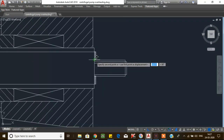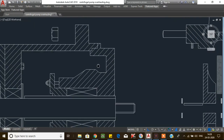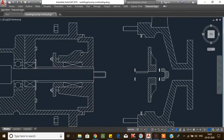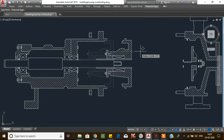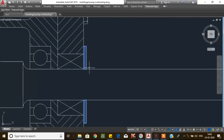Remove the sleeve gasket. Then you can remove the stuffing box unit along with the sleeve directly. There is a bolt between the bracket and the stuffing box — you should remove that bolt first. After that, remove the stuffing box unit along with the sleeve. Then remove the oil or water thrower.